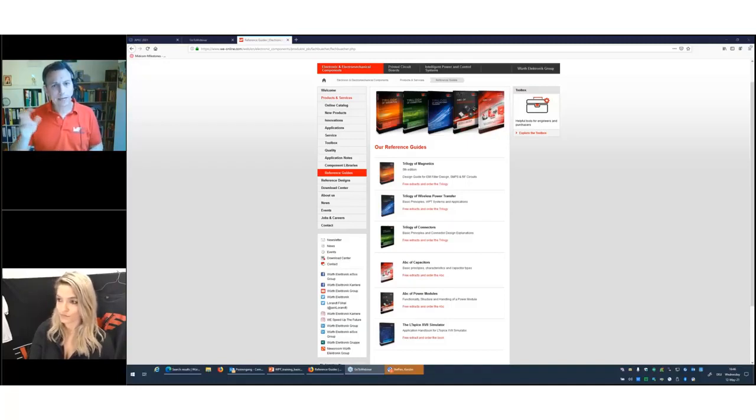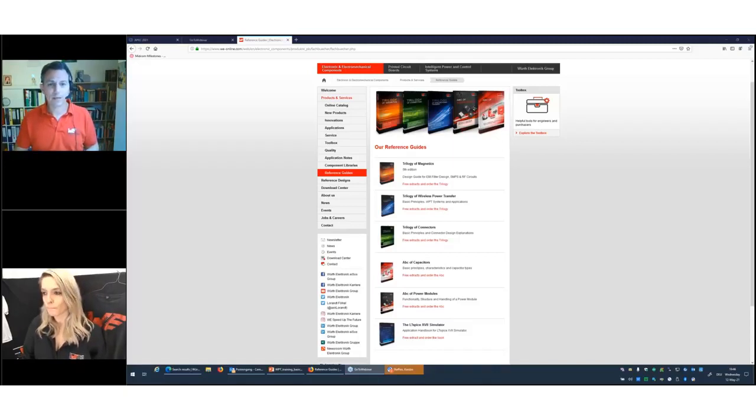But there are also special IC reference designs, for example, from Linear Technology, which is now Analog Devices. They have systems which are used for, I don't know, smartwatches, for example, applications up to 2.5 watt. But also, I think, I'm not sure, TI has a 2.5 watt solution. So there are for sure lower power ranges possible, but they are out of the Qi certification. You can use this, but then you have to do all this EMI and other certification on your own.